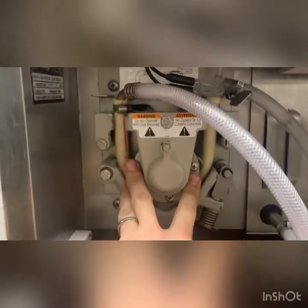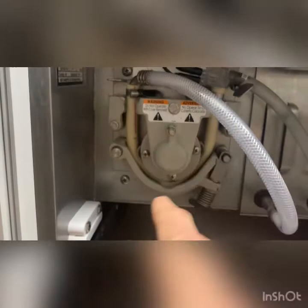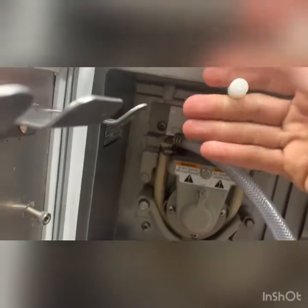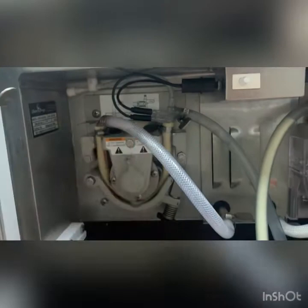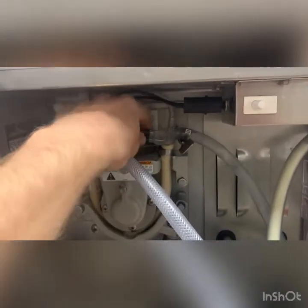They call them red line hoses because you have a red line on them. The only thing separating the high pressure side from the low pressure side of this hose is that it's pinched off at these wheels. This swings down and pinches down — when that wheel spins this way it basically creates a vacuum, draws a little air in the appropriate amount, and then goes. You can change these tips if you need more or less air, but as they are it's not a tip issue — those tips make minor changes. If there were a leak somewhere you'd think it would be spraying. If this were not tight it's under pressure right now, it would be leaking. If there's a leak on the vacuum side somewhere, when the pump runs it's going to drink its fluid but also be sneaking in air, and I've seen it happen at these little plastic things and it's really hard to find.